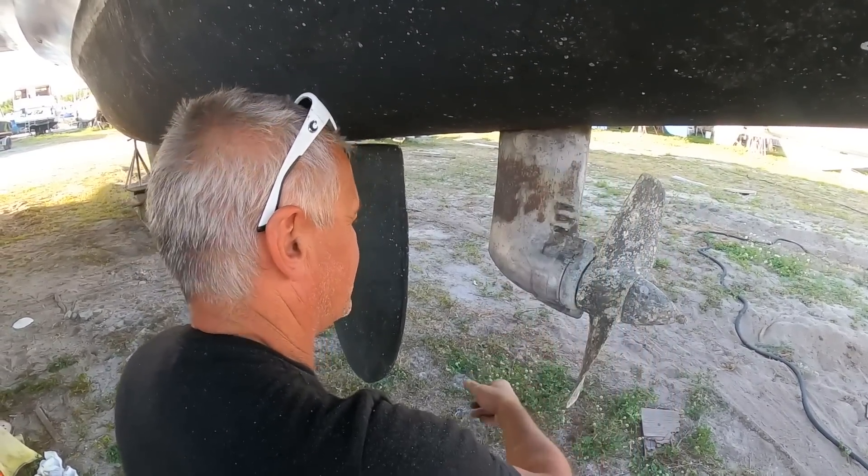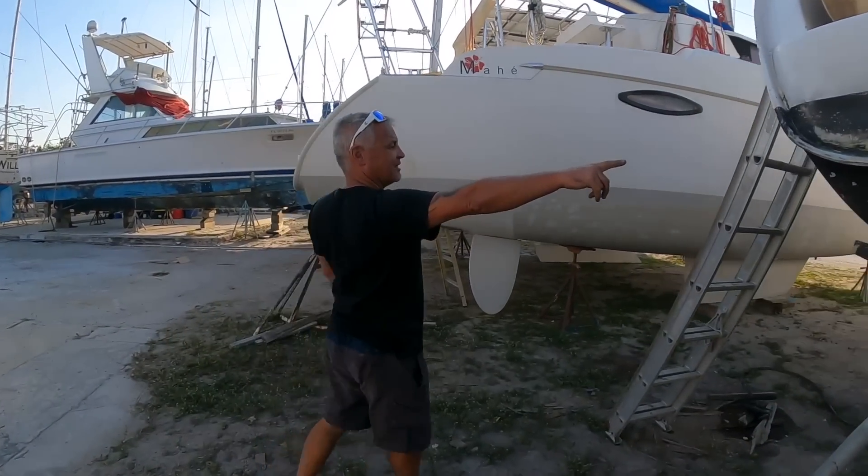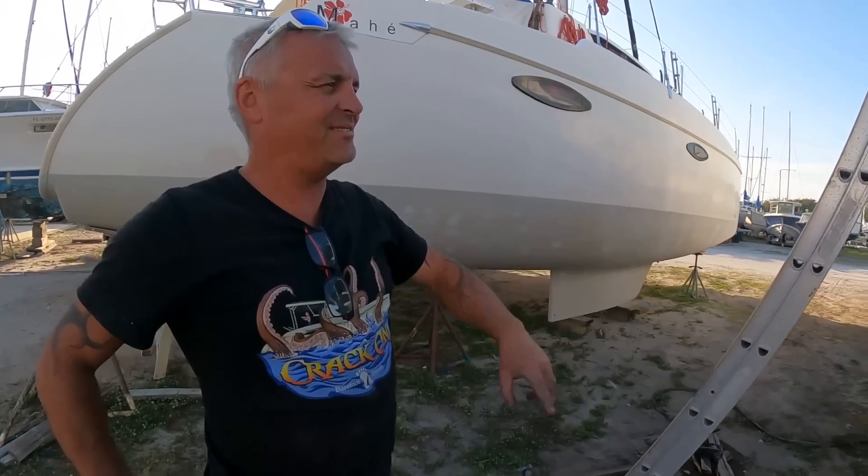More so with the sail drives, I'm going to be changing the water seal. This is like a prop shaft in here and there's a little seal that protects the oil and the water, so I'm going to change that one out. And then the oil — I'm going to drain that as well. I sanded it a little bit there — that's what we need to get it back to, ready for paint.